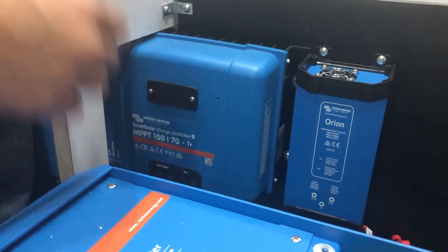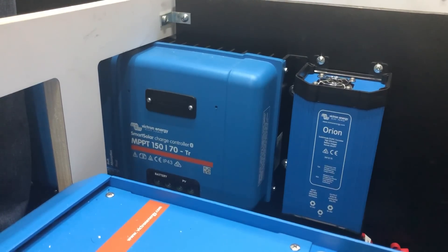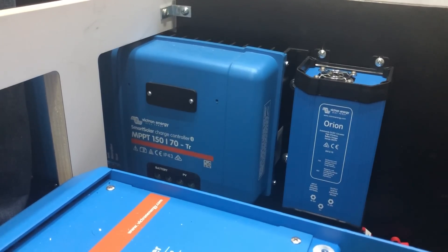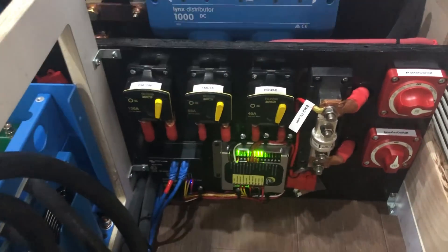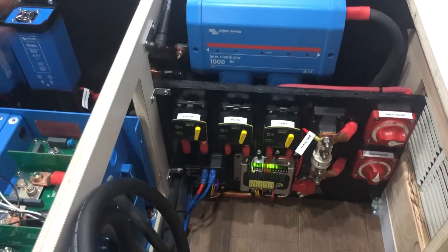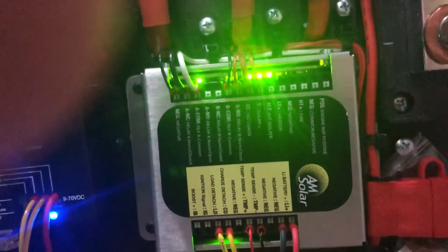For the roof mount array, there are seven 98-watt panels and two 90-watt panels connected in three parallel groups of three in series. The output of this charge controller goes through a breaker and onto the battery bank. Like the portable panel controller, this one is also controlled by the V4.3 board to prevent frozen charging or feeding current into batteries that are 100% fully charged.